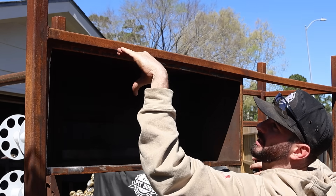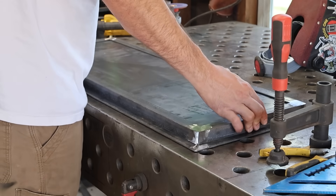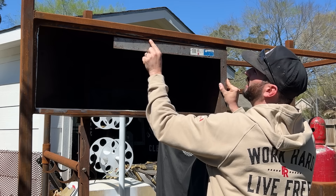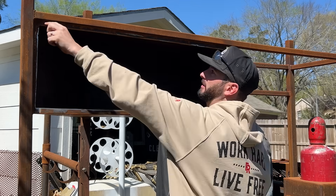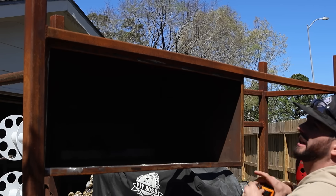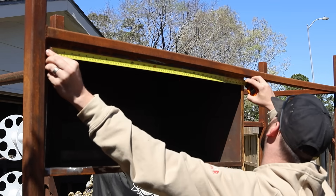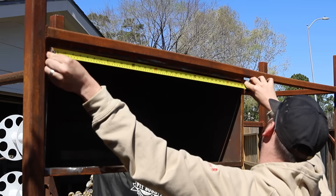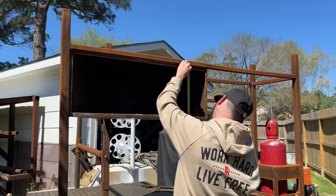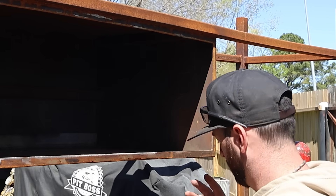The other one's going to be facing more like this - one facing in, one facing down - so that everything fits in like a door. Being that this is probably not square, there's a lot of gap there. To make that straight again, the angle iron spacing is going to cover up all the damage. We'll find the right length where the end of our leg facing out just covers up. We've got somewhere around 36 and a quarter, and 13 and a quarter.